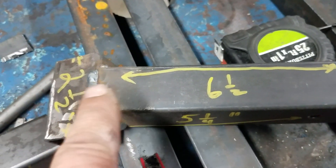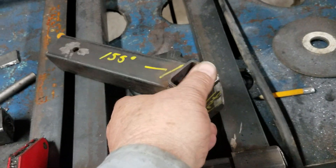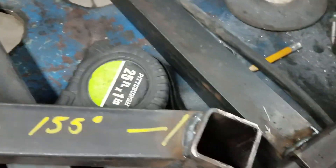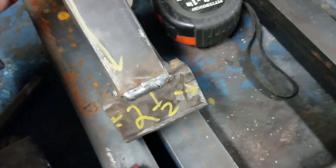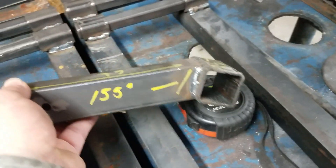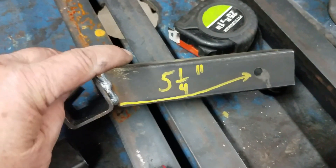These arms are six-and-a-half inches long from the end — I still have to cut that off, that's why I gave six-and-a-half inches. They're cut at an angle. I'm not a machinist, but through trial-and-error I got it: it's a 155-degree angle cut on there. This is inch-and-a-half square tubing, eighth-inch wall — actually one gauge lighter just to save weight. Six-and-a-half inches long, two-and-a-half inches wide, at a 155-degree angle with the hole five-and-a-quarter inches from the bottom of the tubing.